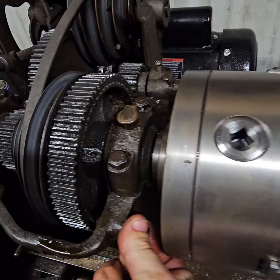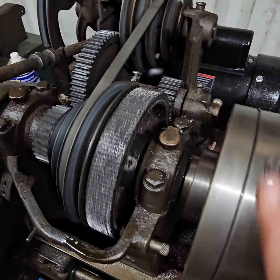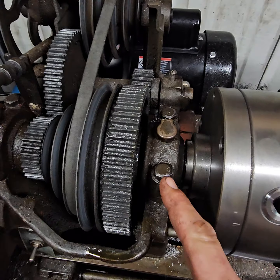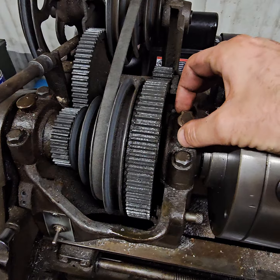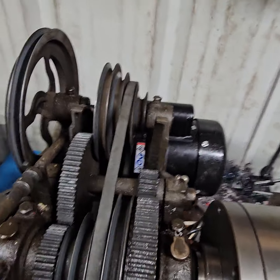And I'm guessing there's a formula to count the teeth, whatever, get it lined up where you want it. I'm not sure, but key points on this thing: pre-1940 you have Babbitt style bearings. If you let them wear out... look, this thing's 80 years old, it still has adjustments. So 100-year plus on the bearings if they're maintained.